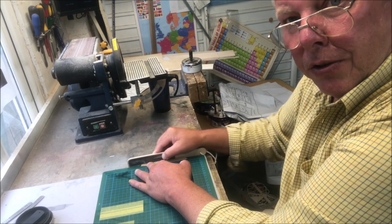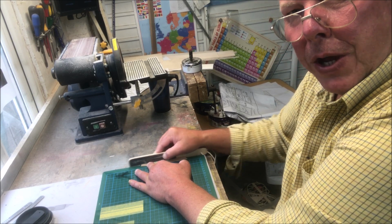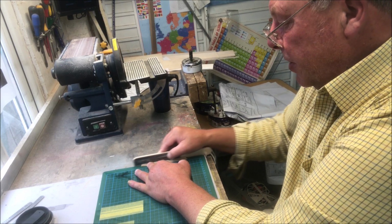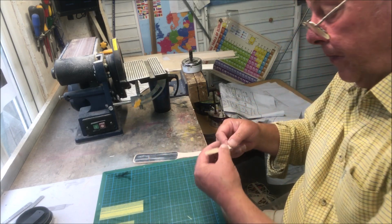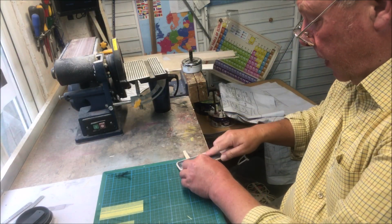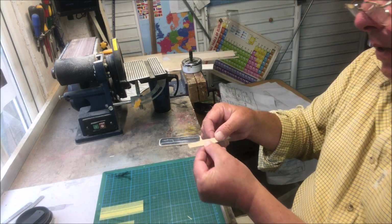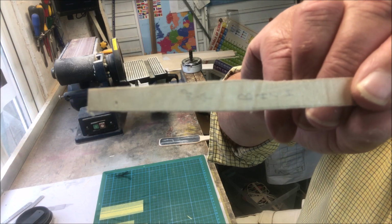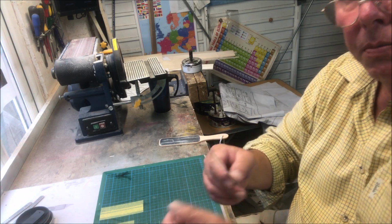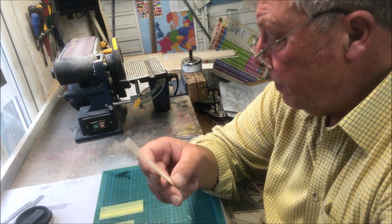So you just keep doing that. Now, for the sake of the length of the video, I'm not going to take it all the way there, because you're just watching some old fat guy sanding a bit of ply, aren't you? So just to show you what the results of just doing that is, okay, you're starting to get nearer the line. Let me just take that bit off there. It's starting to go flat and level, and it's getting very much nearer the line. And because you're doing it by hand, you've got more control, and this is what it's all about, having the control to get it to the right shape.